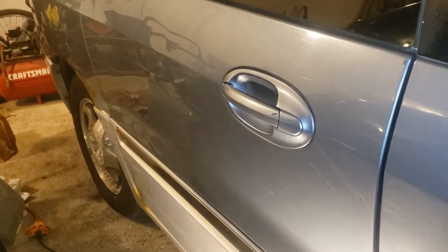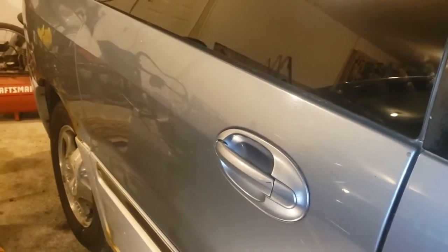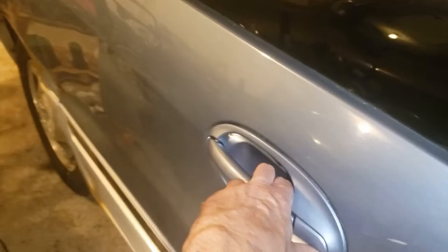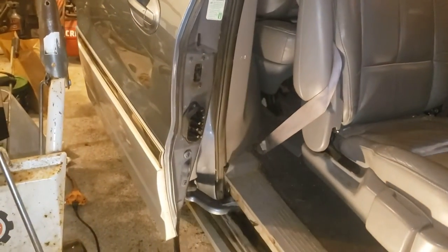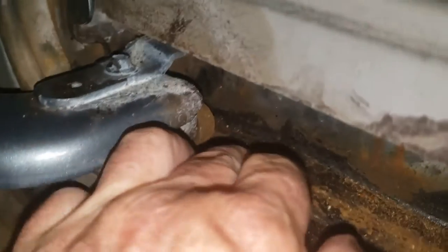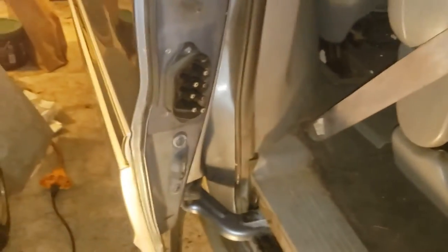But a relatively impactful problem with the track on the sliding door, the right rear door, passenger side. And if I go to open it here, you're going to see it'll kind of drop down into a kind of a deficit, and you might actually be able to see the problem that I've seen incurred here. All right, you'll see it just drop down a little bit. If you look down here, the roller has fallen down into like a rot hole. Button there, and we'll push that, and you'll see it won't close. It's jammed in there.